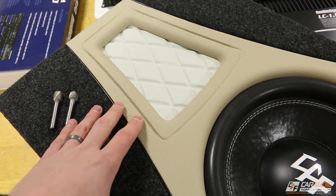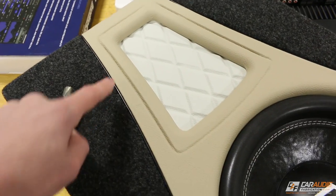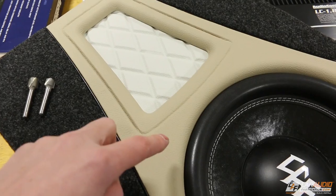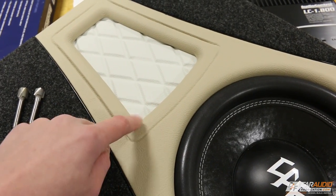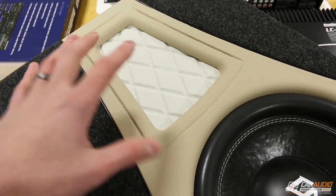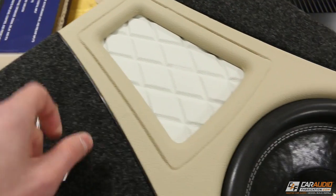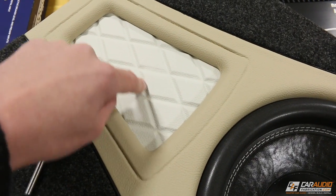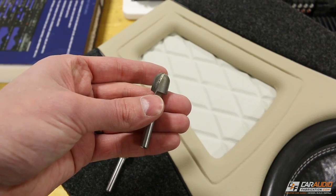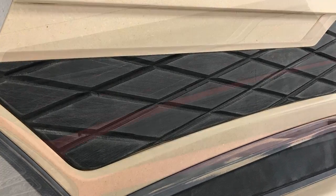This was just a practice panel for me to show you guys these techniques. One thing I would do differently in the future is on this part here I used a straight cutting bit because I was planning on transitioning between two different color vinyls, but I ended up deciding just to keep everything one piece of vinyl. So what I would have done differently is use one of these profile bits instead — so this outside shape here would be much like the flat chamfer, or I could have used the half inch round. Live and learn — but now you know some cool techniques you can use to add some more impact to your future builds.